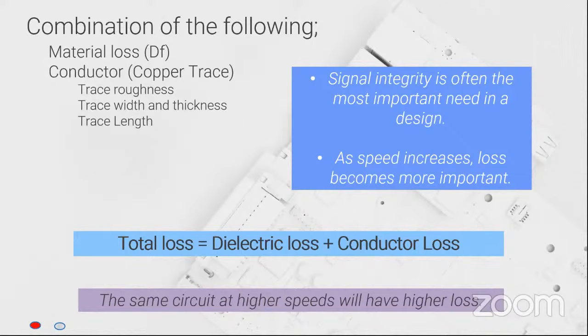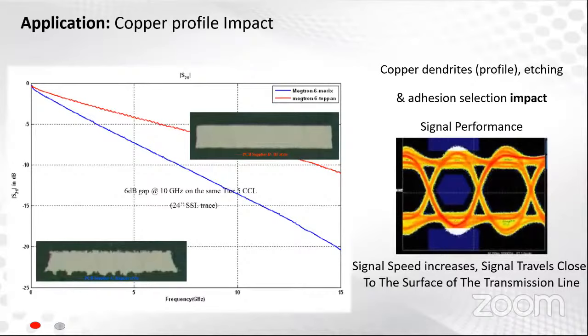The energy you lose in these materials is very small, but it adds up. The same circuit at higher speeds will have higher loss. Let's say I have an FR4 material with a four-inch transmission line — it may work totally fine at two gigabits, but as I go higher in frequency, the response starts to flatten out, loss increases, and it may not function. FR4 — you're going to be thinking about a higher-performance material somewhere in the three to five gigabit range. When we talk about data transmission we're talking about gigabits; for RF, gigahertz. In that range you should start thinking about something other than FR4.